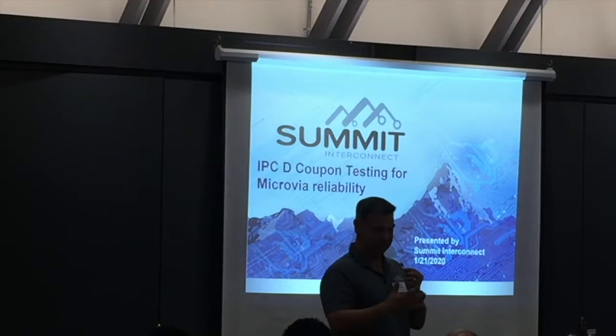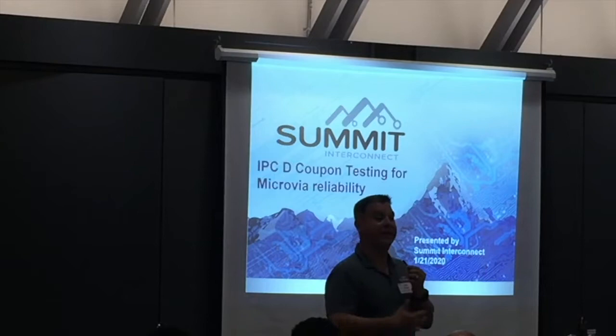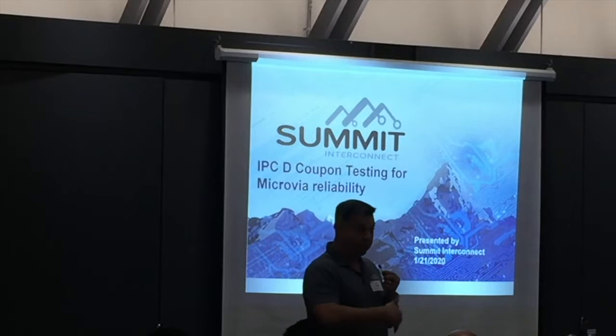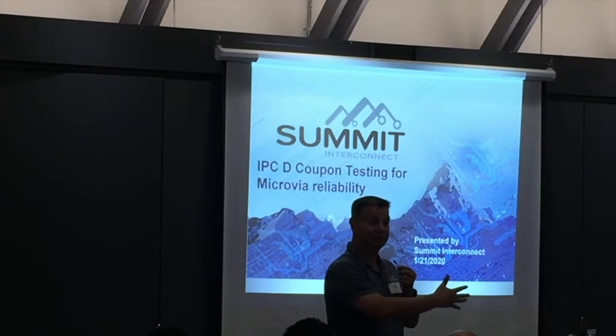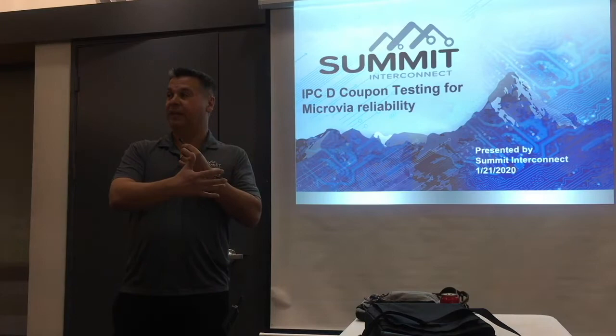You're free to disagree — I've been building them that way for years, I know. Just to give you some background: I'm going to talk about a test with concerns about stacking three microvias or more. They say maybe you don't do it. I built a 30-layer board that had microvias in every dielectric. We delivered it in six weeks. I can build them — they just don't survive the assembly. If we move along well, I'll get into some really good examples of three-stacked microvias that actually pass and when they actually fail.